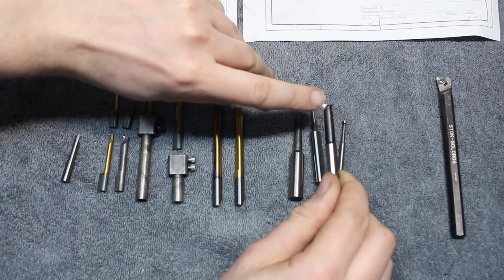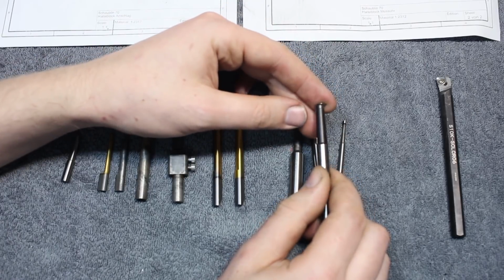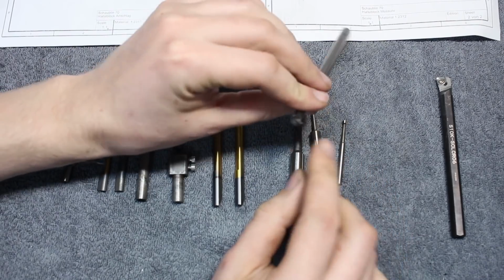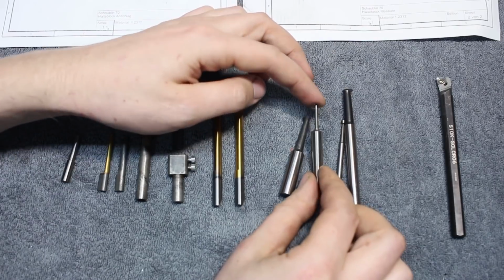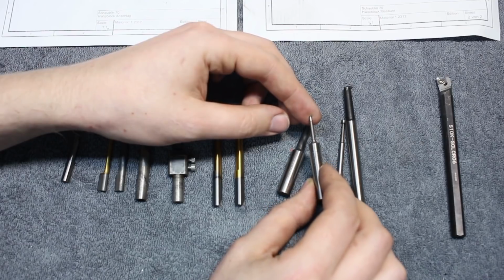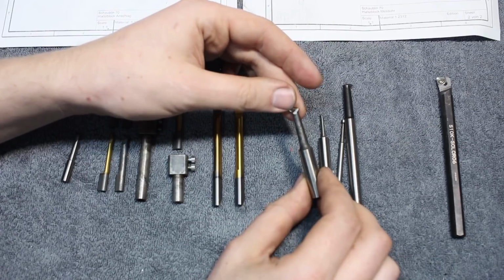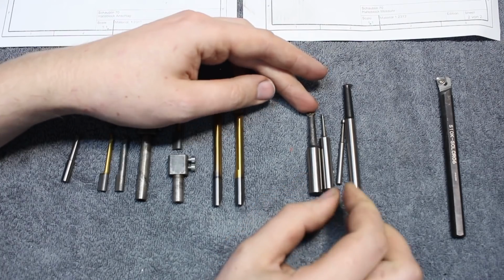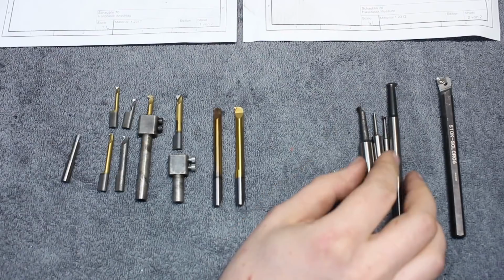And you grind them here on the chip surface and you just rotate them into the grinding wheel, and you can regrind them forever until nothing is left anymore. But if you regrind them wrong, you butcher them up really bad. And these start at really tiny diameters. This one can go into a 3mm bore without a problem. Not very deep though. I don't use them very much anymore because they're high-speed steel. And if you work with a lot of tool steels, you burn them up quite fast, or you have to go slow as can be.